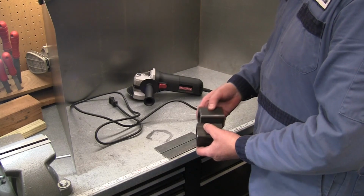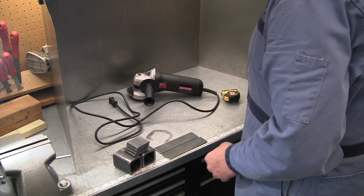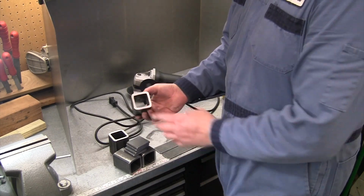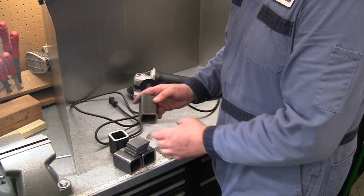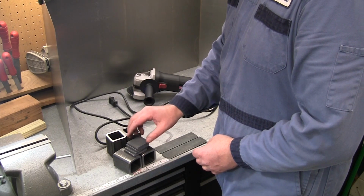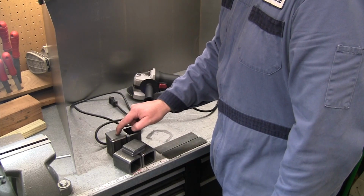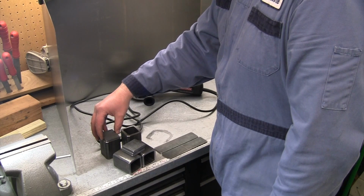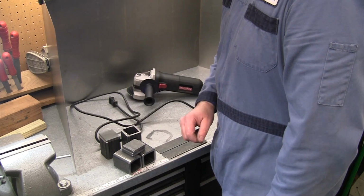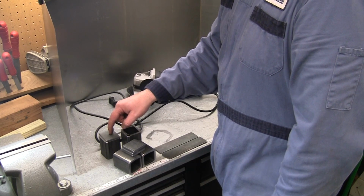We've got our four legs cut, and we've got the four caps cut for those as well. I'm gonna go stick these in the lathe and I'm gonna face off both sides, make sure that they are nice and square and flat. Also, just make sure I get all these to the same length, and then we'll go out there, we'll weld our caps on. Just gonna run a bead down both sides. Left a little bit of room, give me a chance to try stick welding with that Miller Dynasty, and then we'll come back in and we'll face that off again, make sure it's nice and square.